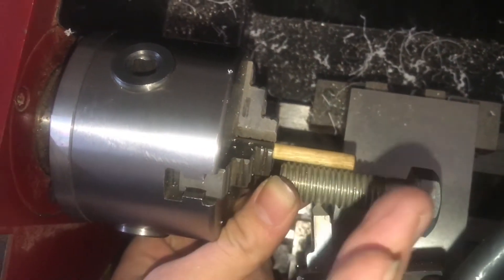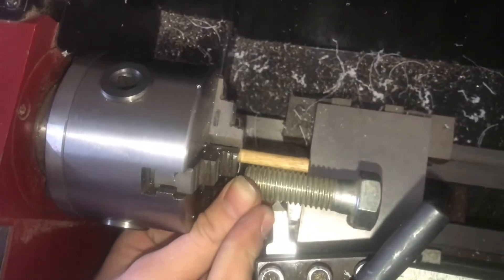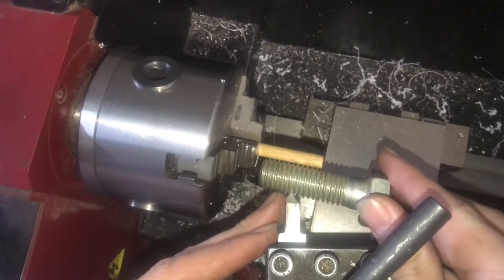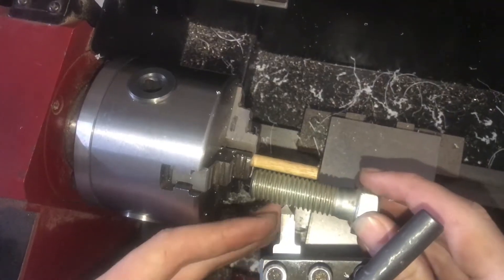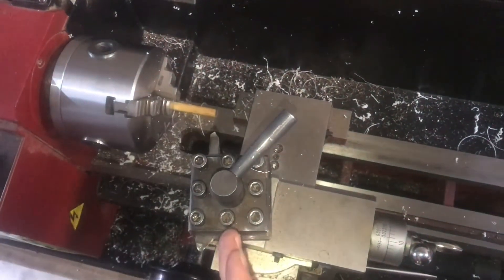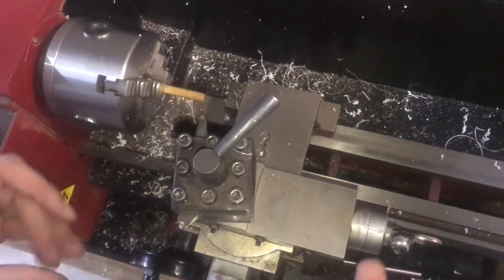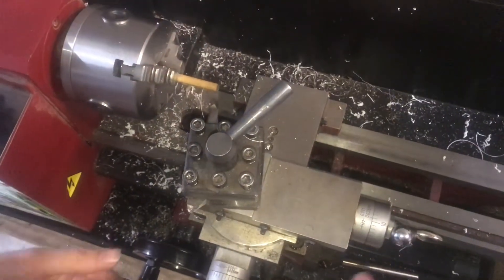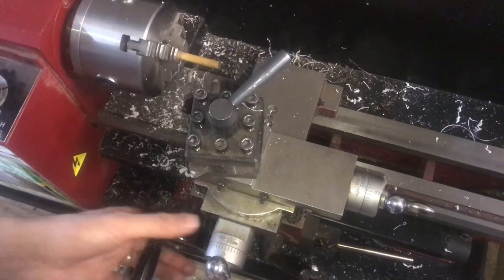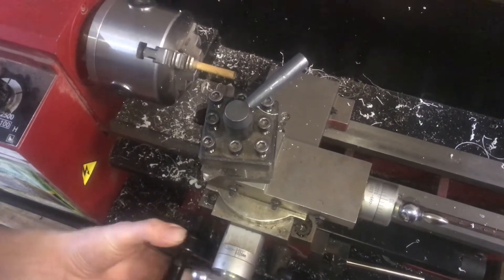This would tell me if the tool is rotated in either direction. It looks like the 60-degree point of the tool is laying just where it needs to be. Technically before threading we should turn the compound rest so that it's about a 60-degree angle and feed in this direction, but since we're cutting wood I don't think it's a big deal — I'm okay with just feeding straight in on soft material like this.